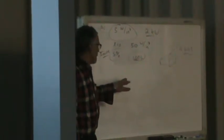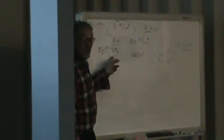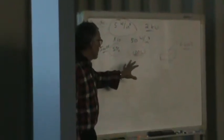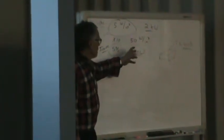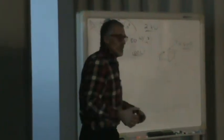So we teamed with UT's power electronics group, their center. We said, okay, we'll get you guys on board to help us with the power electronics. And then the other side of the house is, well, we know you've got to have some inefficiency, 1%, 2%, 3%, something. Let's get the heat out. So that was our job. That was my job. The idea was to take a multiple problem approach: do a bunch of finite element models and try to design fans and grills and stuff that would flow the air around the components and get the heat out as best you can. Or do we want to use liquid cooling or phase change or all kinds of weird things? Can we shrink this down?